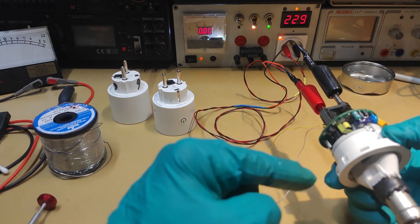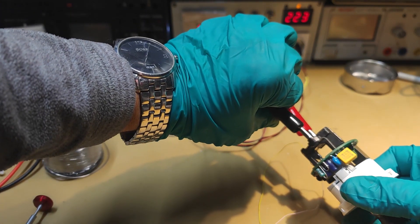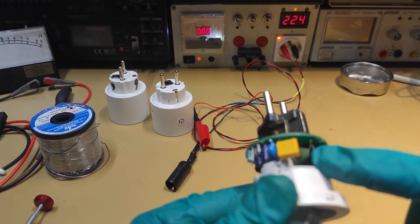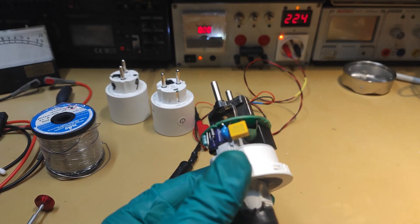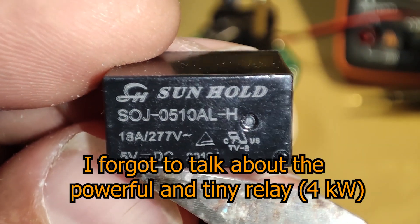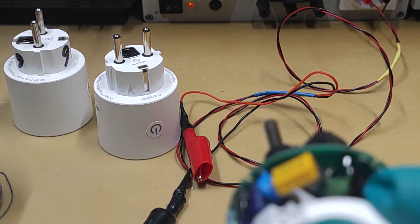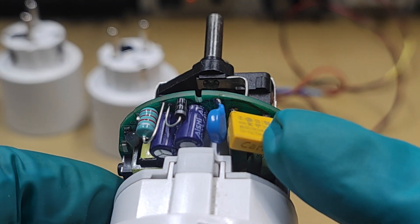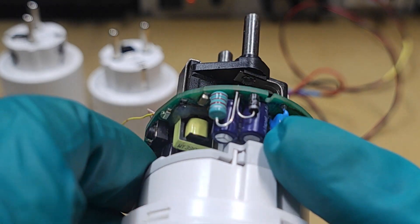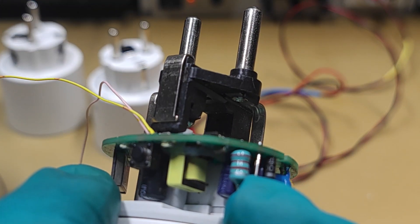This one works with an external power supply, but there is a short — this is confirmed as a short. The short is not good here because when this component gets very hot it is not able to provide enough current. Looking at this PCB you can see a double-sided PCB with a PTC, a capacitor, and X and Y capacitors for filtering, other capacitors for filtering, a rectifier, and a little inductor which also behaves like a resistor.